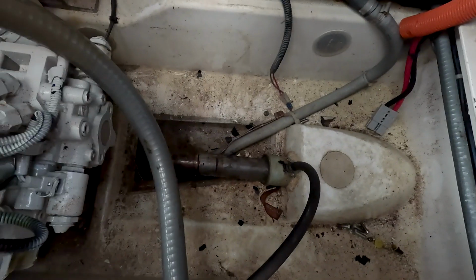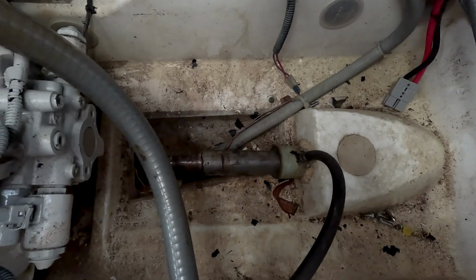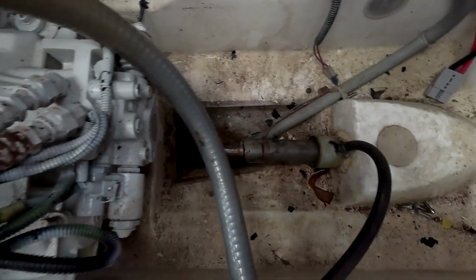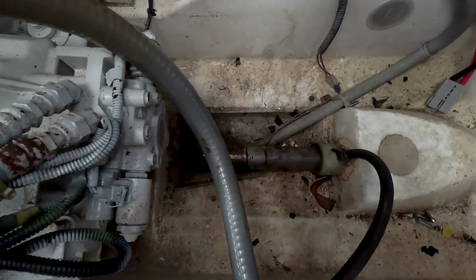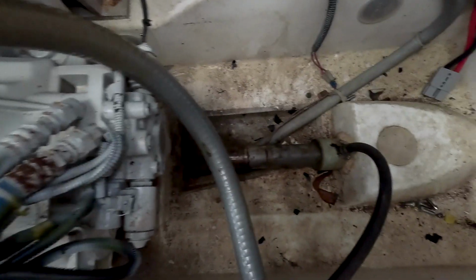After the shaft seal, we've got to put a gear on, because these brackets right here are what hold the electric motor above the shaft, and it's connected via a gear. You can probably still see the black mark right there where the gear goes. And then we've got to get the 2 spare belts and the coupler on there and make all of that fit in that tight little spot.